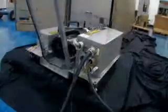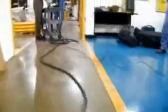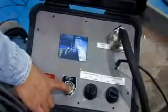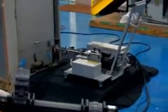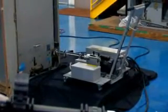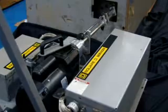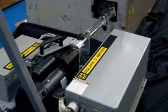The control cable is connected between the racking cart and the remote operating station, which is moved up to 50 feet away from the circuit breaker cell as permitted by the control cables. Switches in the remote operating station activate the racking operation from fully disconnected to test position to fully connected position, all at a safe distance from the energized cubicle. The motor will automatically stop when the circuit breaker racking process is complete. With an optional camera and monitor, the entire racking process can be viewed remotely.